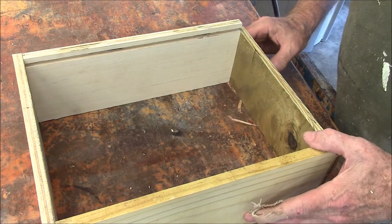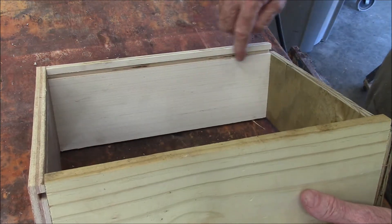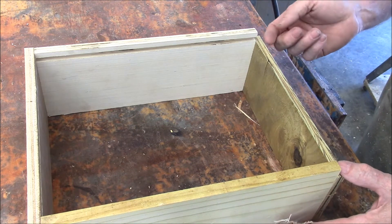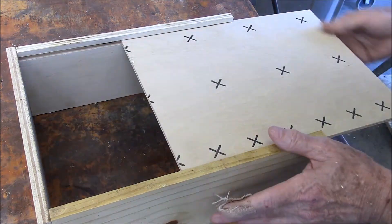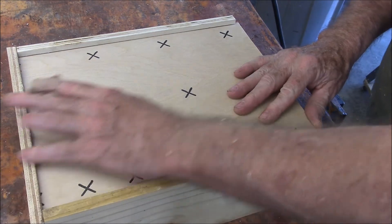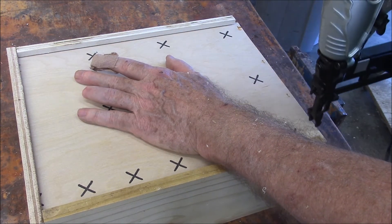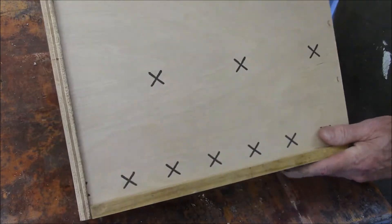This is about the simplest way to make shop drawers I've found. It's basically just a little box, and on three sides around the edge there's a dado. The back piece is cut right up to the bottom of the dado. Then you take your bottom, make sure it's nice and square, and slide it in all the way — it provides the bottom. Then you just nail the end down here and there you've got your drawer. Let's install it and see what we've got. There's always a wonder if it's going to fit.